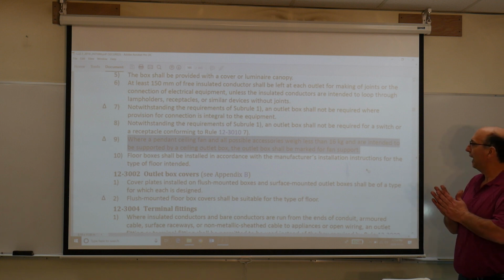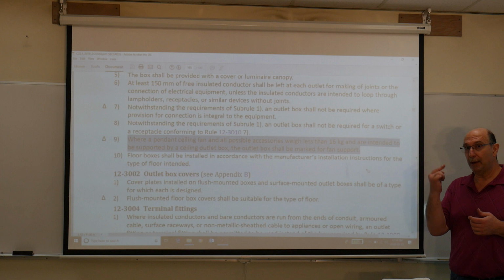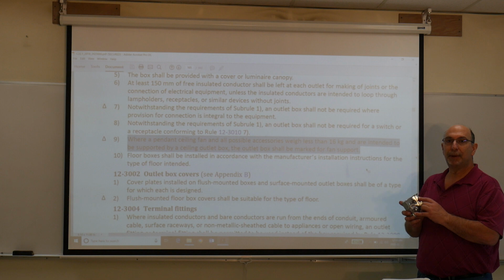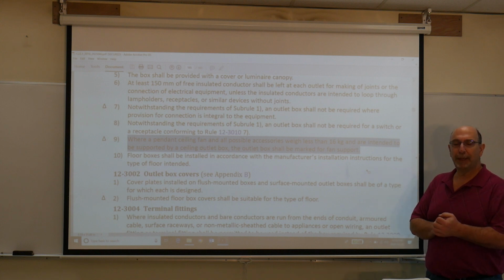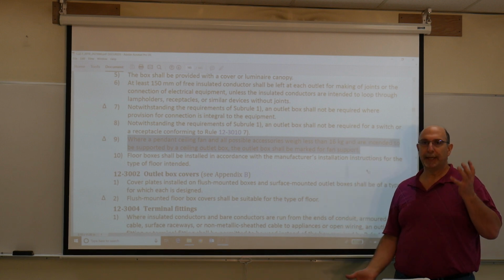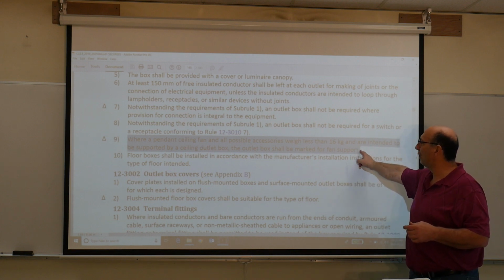So what this pertains to is these brand new boxes that have been out for several years. They are intended to hold heavy luminaires or ceiling fans because they, of course, oscillate quite fast, and they're sturdier than your typical device box. And they also use, instead of 8-32 machine screws, they use 10-32s. And these boxes are meant to handle larger, heavier loads. You know what it's like when the summertime comes, people turn the fan on to warp speed, and that fan just gets oscillating. If you haven't supported the fan properly, then the screws become loose. Next thing you know, the ceiling fan hits the ceiling, and you've now gouged out your ceiling. So make sure you use a box that is approved for fan support.